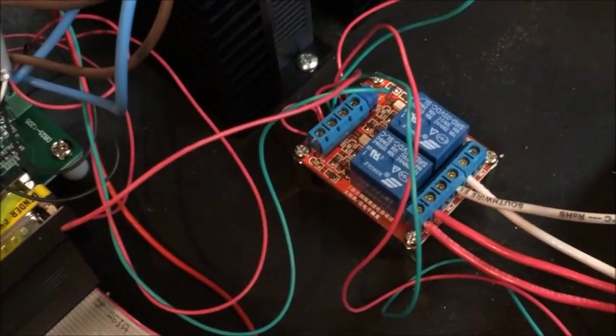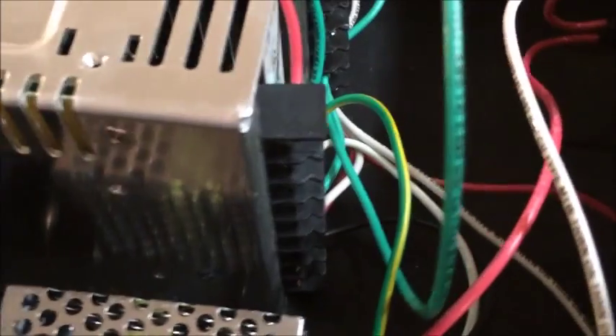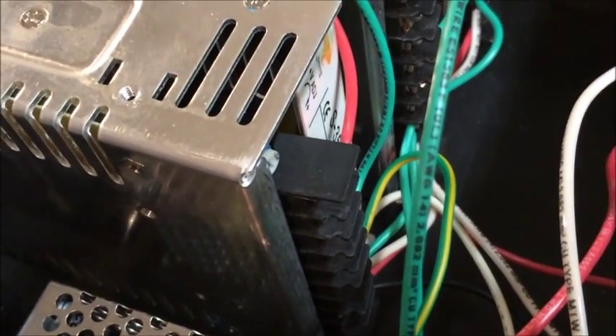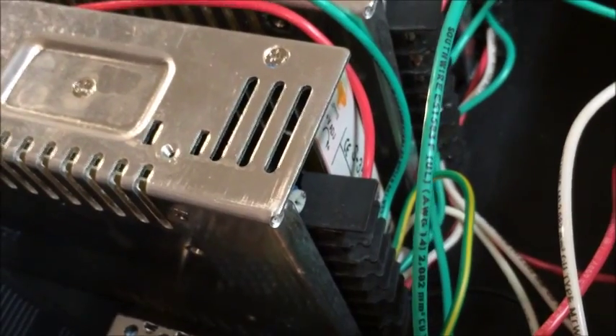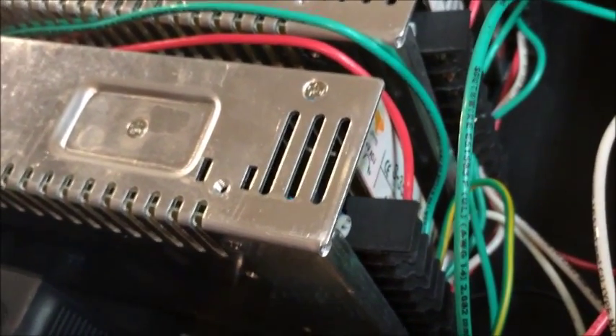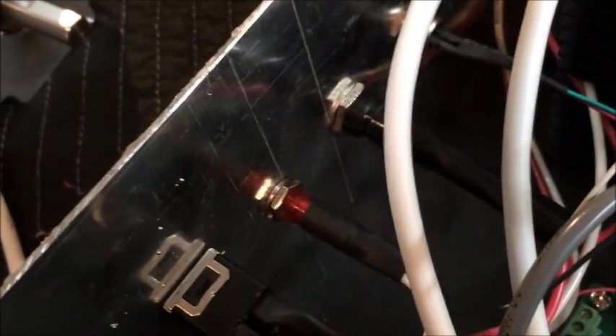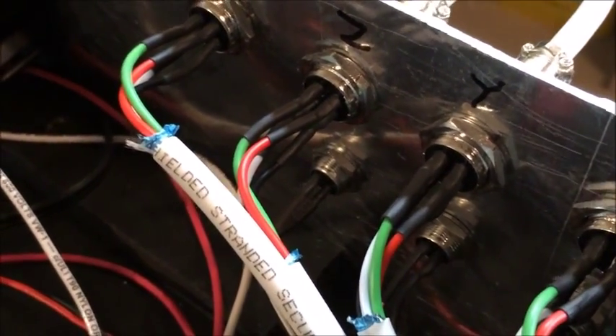Both sides are switched. For wiring up the high voltage connections inside, I used 14 AWG appliance wire I got from Home Depot. It's stranded wire, so it's very flexible and has the proper jacketing — oil resistant and temperature resistant. I also tried to use shrink wrap wherever I could to cover up all the connections. I think it offers a degree of safety and also makes everything look a little bit more professional — at least as professional as a homemade CNC controller can be.